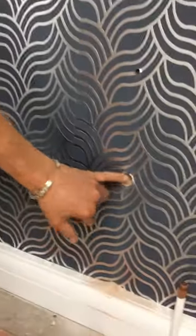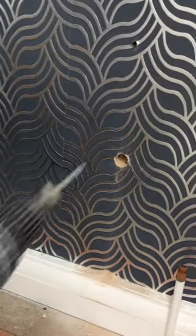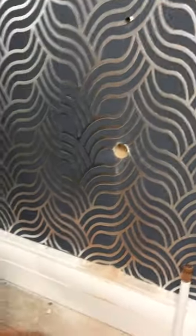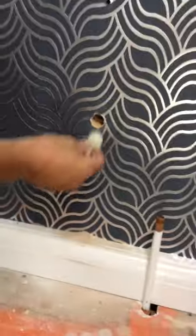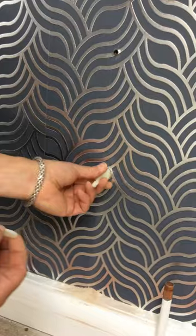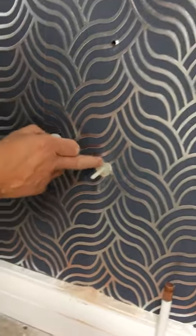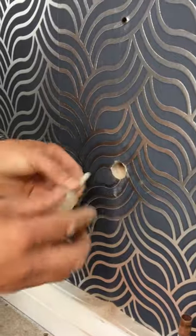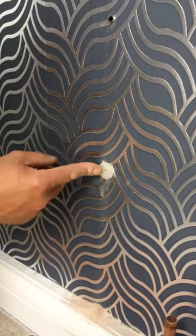This one down here — I happened to hit half of a dab inside the hole, so I continued to drill through to make that a lovely round fixing. So I could use the wall anchor itself. I put the wall anchor in reverse and used a sleeve because it was slightly deeper in the hole. Then I put one of the spacers in and turned it round to fix in the wall.